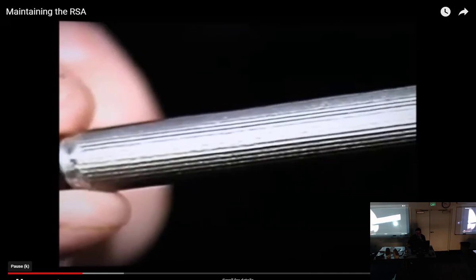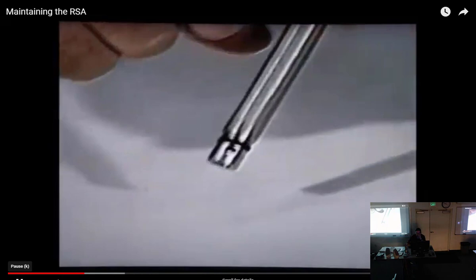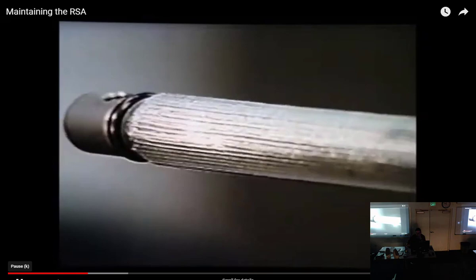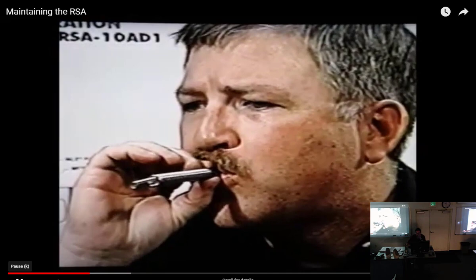Dry the filter with air. Now, tap it, open side down, on a clean piece of paper. Examine any contamination and determine the type and source. Next, look into the center of the filter while shining a light through the outside. You should be able to see the light through the weave on most surface areas. You could also blow through the dry filter. There should be very little restriction to airflow.